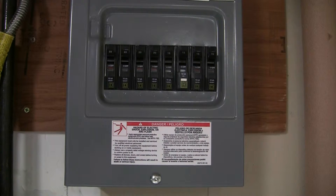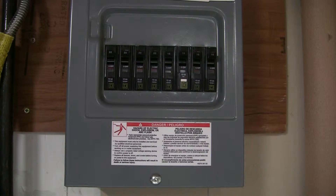That microwave is one of the three circuits that's going to get upgraded and separated out. That outside outlet I really don't need on there. The sixth one, which you see with the little white button on it, is an arc fault breaker. That's for three of the four bedrooms. The next one is kitchen overhead lights.